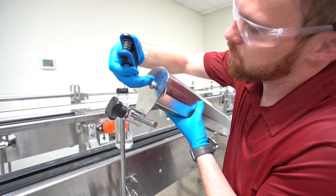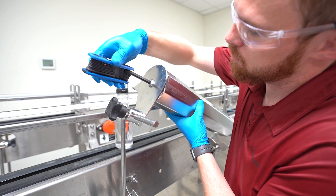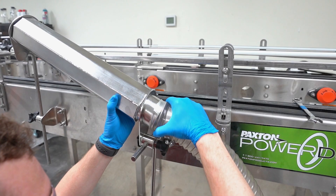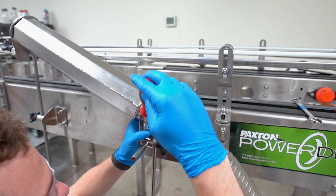The pitch of the air delivery device is recommended to be about 10 degrees. Fasten the air delivery device at the appropriate angle using the threaded M12 bolts. Install the hose from the blower or divider onto the air delivery inlet and fasten with hose clamps.